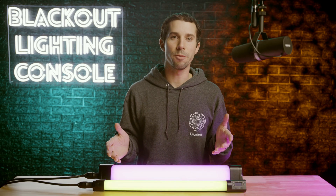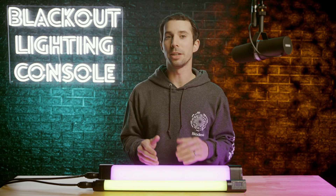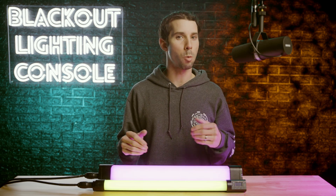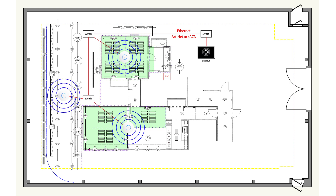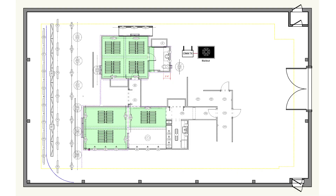There are a few updates I'm waiting for which would really take this light to the next level — specifically being able to client into an existing wireless network. That means if you connect this light to your wireless lighting network on a stage, it could pull Artnet or sACN data. The advantage is that you can set up a robust wireless network and keep expanding it by adding more access points, whereas you're stuck within a certain range when using a single CRMX transmitter. But this feature still has some work to do before it's truly user-friendly and usable on a film set.